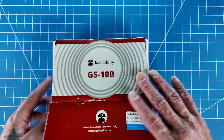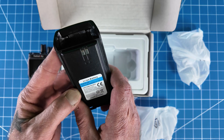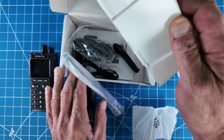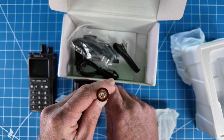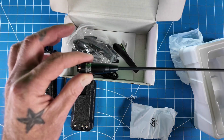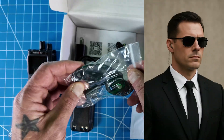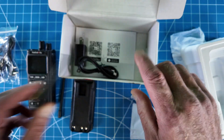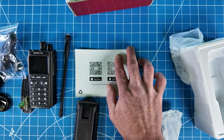What's in the box? It's a pretty standard box with a radio and a battery — though there is something a little different they're starting to do with these boxes. The battery is 2,500 milliamp-hour according to the sticker. You get an antenna, but since this is a tri-band radio, the included antenna is only good for 2 meters and 70 centimeters. It would be nice if it came with a tri-band antenna. You also get a secret service-style earpiece, a belt clip — I like these newer styles where you just clip it in without fiddling with a screw — USB-C charging, and a dock. There's also QR code access to Bluetooth programming in the manual.